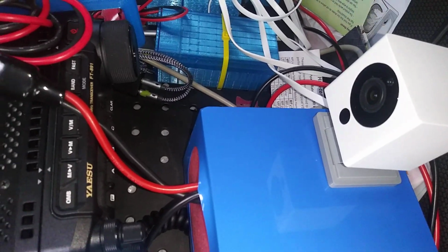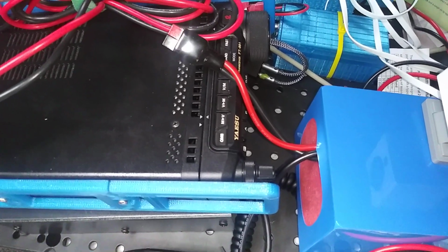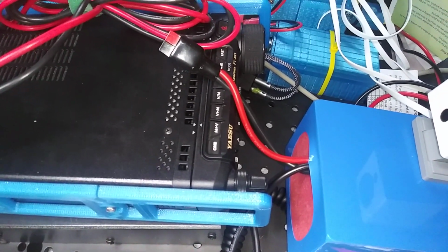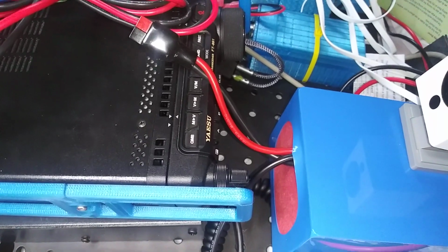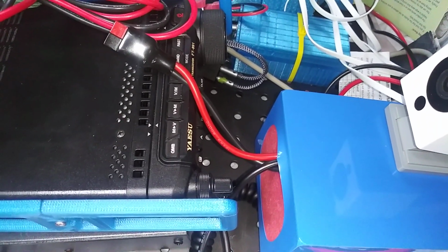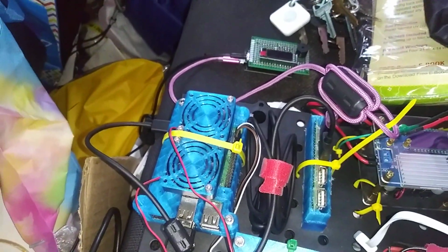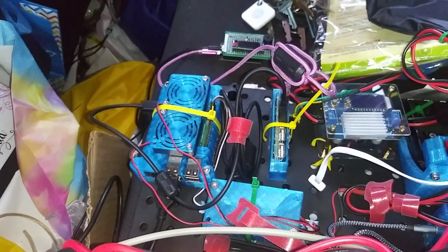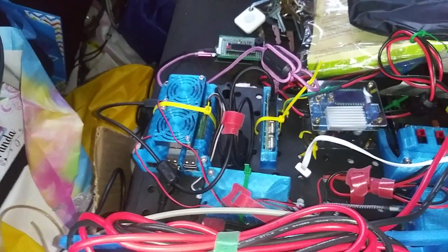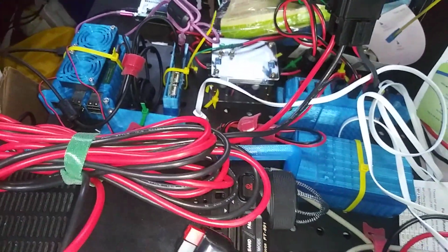Whatever, it'll work. So what are the next steps on this? I'm probably going to get a little foldable solar panel to put on top of the car, and a charge controller, so that I can keep the battery charged. Right now I'm coming out every night and pulling the battery back inside to recharge, but with solar I could just leave it out here and let it charge itself. The other thing I want to do is I have that microcontroller and the Raspberry Pi, either of which could easily get temperature data from a cheap sensor, so I could see in real time what the temperature is inside the car, if I have any concerns about heat buildup.